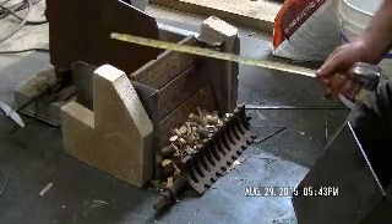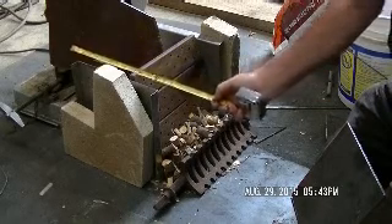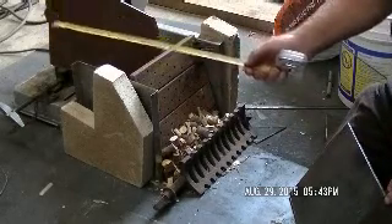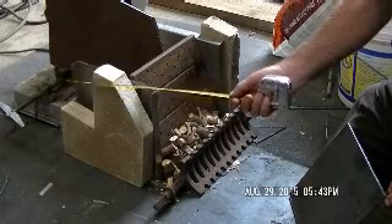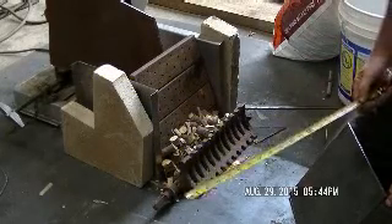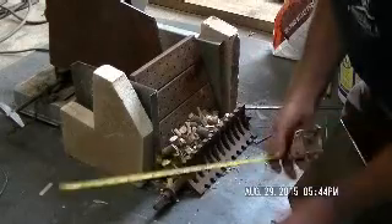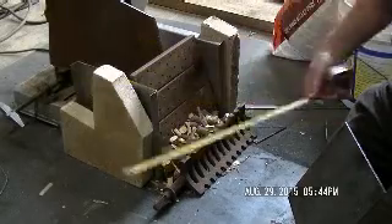What I've also come up with is casting some refractory bricks for the sides — they'll be about 13 inches, starting back in here, all surrounded by refractory for the heat. Then on the outside I'll have this high-temperature rock wool, or mineral wool — they call it thermal fiber — which is good for 1700 degrees. With the refractory first and then the mineral wool on the outside, I'll be able to use regular light plate on the outside and it'll never get hot there.